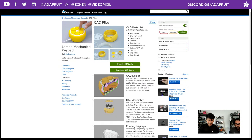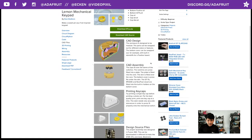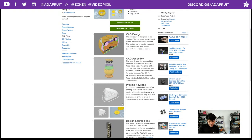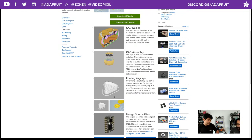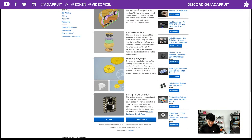This is the first guide where I broke up the 3D printing and CAD files into their own pages. I have a download link to the ZIP file and to the CAD source — a STEP file and the Fusion 360 file. There's a CAD assembly GIF showing how all the pieces fit together. I'd advise printing one keycap first to check tolerances before printing the whole set.